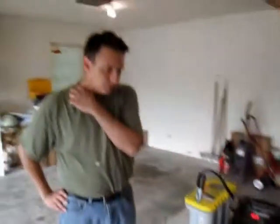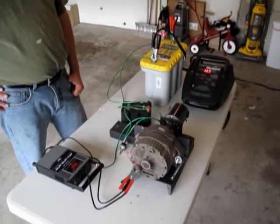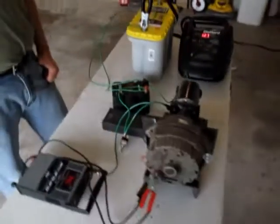That's the whole thing, start to finish. It performs the same. It's still draining the battery. It'll drain it slower, but it still drains the battery. And it's a little more efficient than running the load straight from the battery, running it through the alternator. It's just a more efficient use of the current. It still drains the battery.